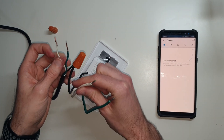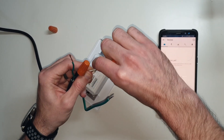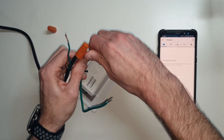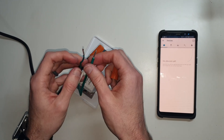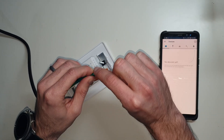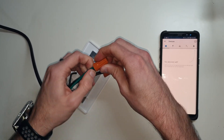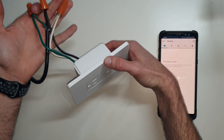In this case, where I'm actually using this test wire, you can see that I'm only attaching two wires inside each of these wire nuts. If your outlet is not on the end of the line of your house, it is possible that you have three or so wires going into these wire nuts. But if it's much more than that, it could be possible that your house isn't wired normally. These may not be sufficient — you may have to have a larger one or look at a different size wire nut. In this case it's simple: two wires in there, and you want to twist it down on there pretty tight. Make sure both wires are in there snug and no exposed wires are touching.